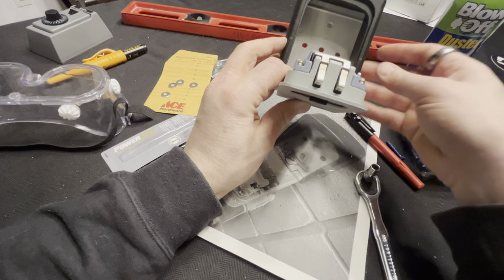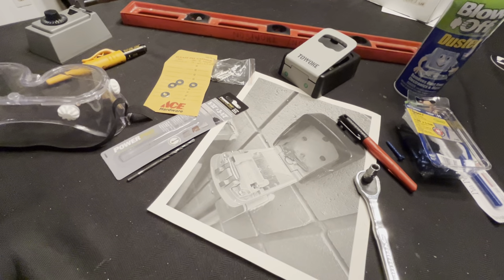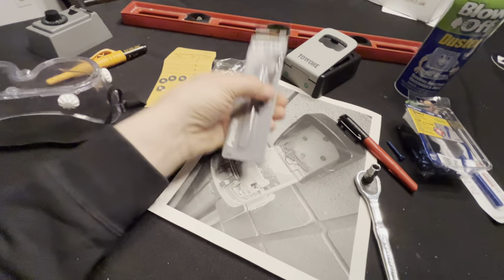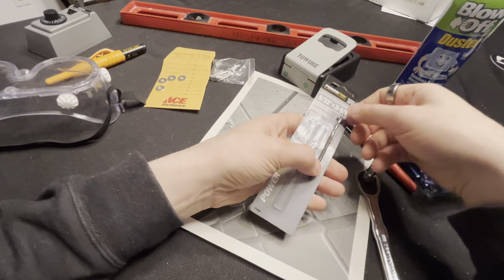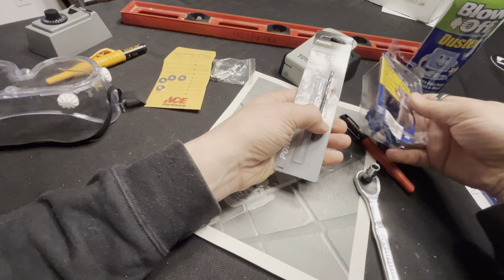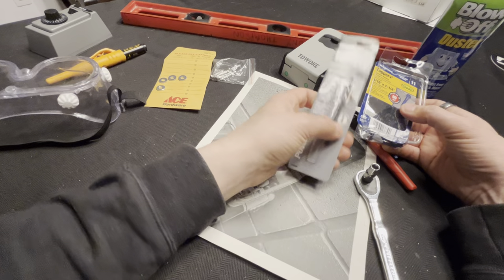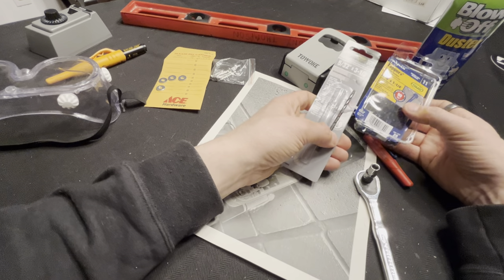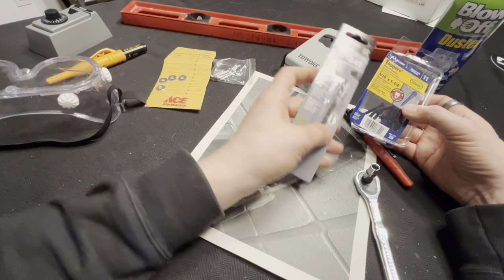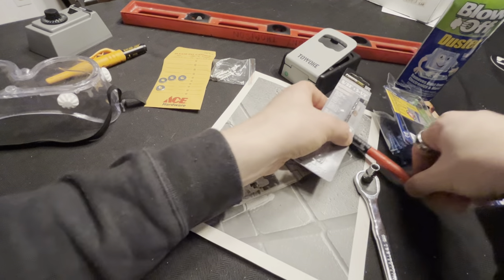One mistake I made — I made a few minor mistakes but it worked out okay. You need a drill bit made for drilling into concrete or brick. This was in the same section as the Tapcons. I wanted the Tapcon brand because it comes with a drill bit, but the Ace Hardware I was in didn't have that. This bit was conveniently located right next to it. Just double-check you get the right size drill bit — it says use a 3/16 diamond anchor bit.